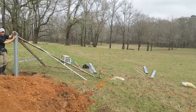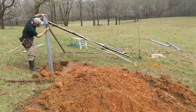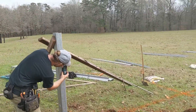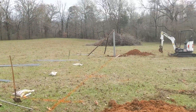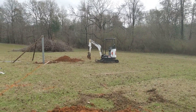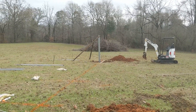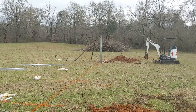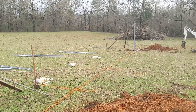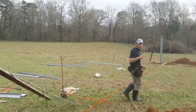We're here setting up a nice little ground mount, and I'm standing right in the laser. This is a Power Peak ground mount that we've had scheduled for a couple months. We've got a break in the weather, so we made a run for New Orleans. We're putting in an 11.2kW ground mount here with a Solark and a 1,000 amp hour battery. We're going to use a PTO generator for battery charging on this one.